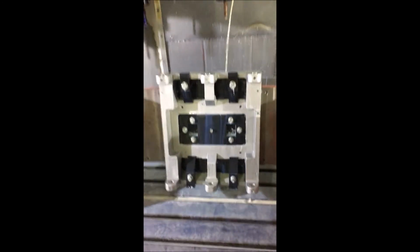And now this is the larger bore. I learned that you have to do it in a separate op, so we're removing more material here because we're plunging and doing a helical bore to move the rough. So we're just barely working it now. And there's our finish right here. And that's it. And there's our finished part.